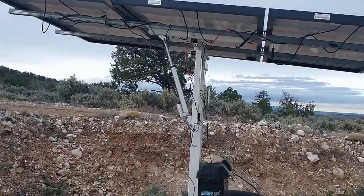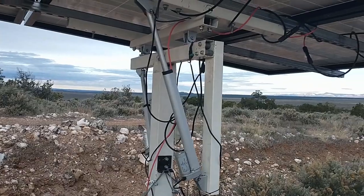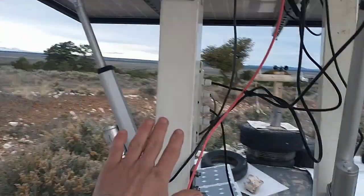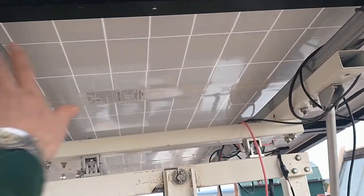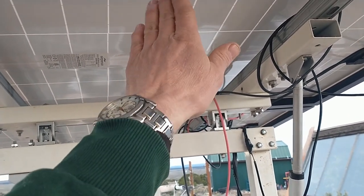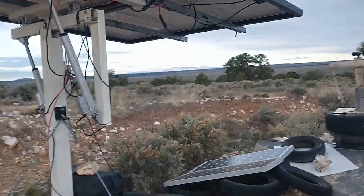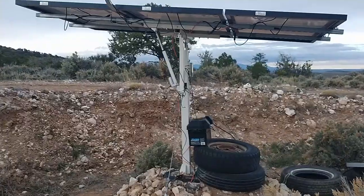The other thing I'm eventually going to figure out is dampening. I'm thinking I'll try to get some kind of fairly long linear damper, and instead of attaching it to this portion, I'll attach it to the center post and create some kind of a cross piece here to have an attachment point centered, so I don't have to worry about it when it tilts. I'll just put a pivot point there and it should work pretty well.